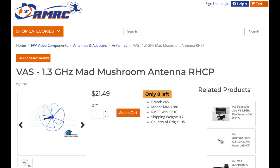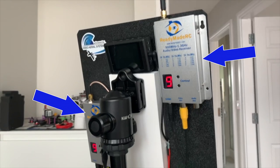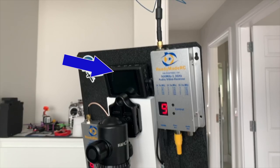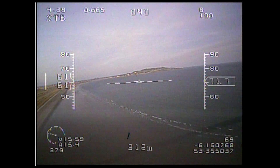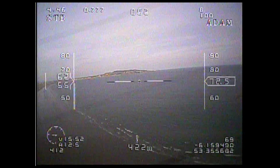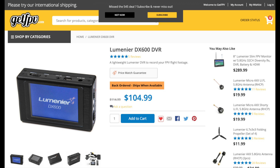You need to ensure that the polarisation of all your antennas matches. This Mad Mushroom is right hand circular polarised, so make sure the antenna on your aircraft, the omni on your ground station, and the Pepperbox are all matching in polarisation. Next you'll need two video receivers in 1.3 GHz — the ones I have are from ReadyMadeRC at $55 each. The next item is a DVR, which records the live downlink from the aircraft. This is really useful because if you have any trouble you can go back and watch the footage to see your last known GPS coordinates. You can get the DVR I have from GetFPV.com for $105, though you may not need one if your goggles have a built-in DVR.